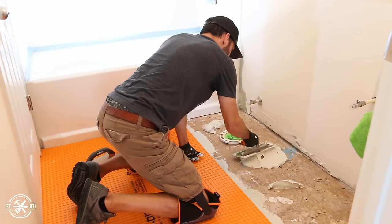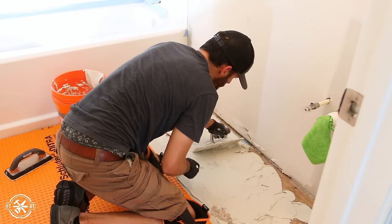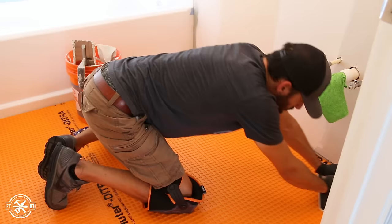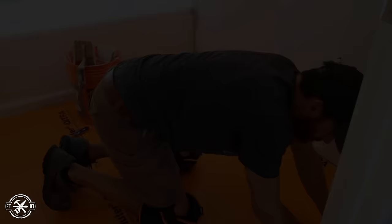I also peeled up a corner to check for adhesion and made sure it was bonding to the subfloor. It wasn't exactly perfect, but it was definitely way better than the original install. Next, I spread the mortar over the rest of the subfloor and pulled in the smaller sheet of Ditra. The fit was perfect up against the other sheet, and for full waterproofing, a layer of Schluter KERDI-BAND could also be added to this joint. You can actually start laying tile on top of the Ditra right away, but it was late so I came back the next day to start the tiling.